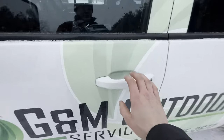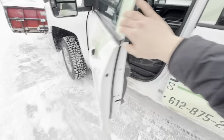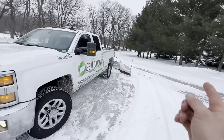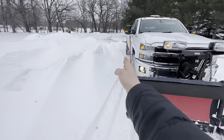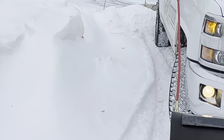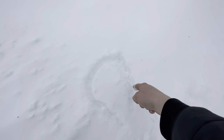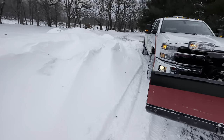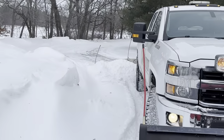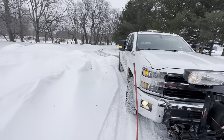Now this is the same 18-degree turn with a back blade — 16 feet wide, the back moldboard is eight feet with a four-foot wing. See here making the same turn — my truck tires are turning perfect, see where the wing is. I'll be three or four feet out. So with an entrance like this I can have the truck over here and the blade is right on the inside corner sweeping it perfect. I can efficiently and actually plow some kind of radius — with the V-plow it just ain't gonna happen.